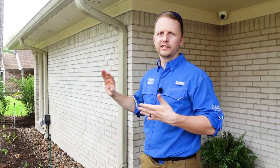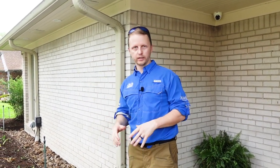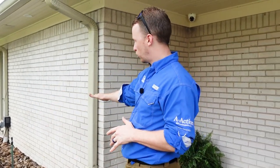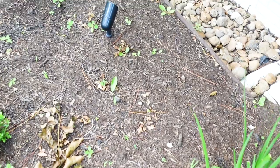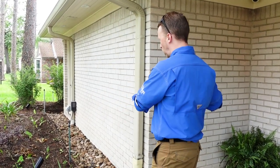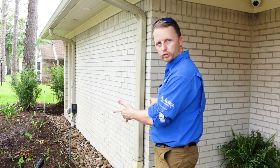We're on a 1960s-1970s home here and what really stuck out to me was how well the grading and drainage is. It's never going to be perfect on a home this age because homes sink over time and they were also built more flat. People like to add in raised gardens, and we have one here which actually puts a negative slope towards the property. But what this homeowner did was separate the flower bed from the structure and added in a rock bed and a French drain system, so any excessive water that heads this way will start to flow and travel back towards the street.